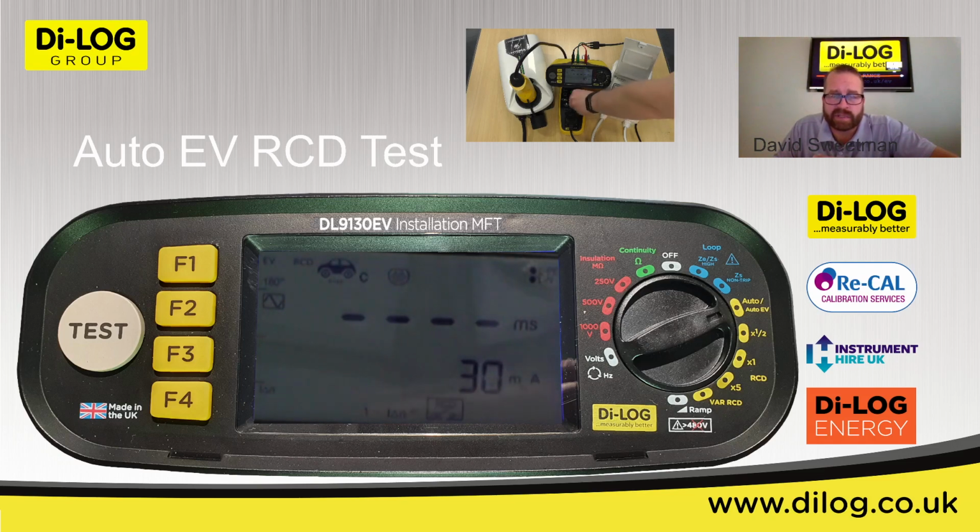As you can see, the sequence has already completed the 6 milliamps test, and we've already moved on to the AC side of the Type A RCD that's on the sub-distribution board. I've simulated a sub-distribution board next to the tester there as well. So we're doing the 0 and 180, the half, the 1 and the 5 times.